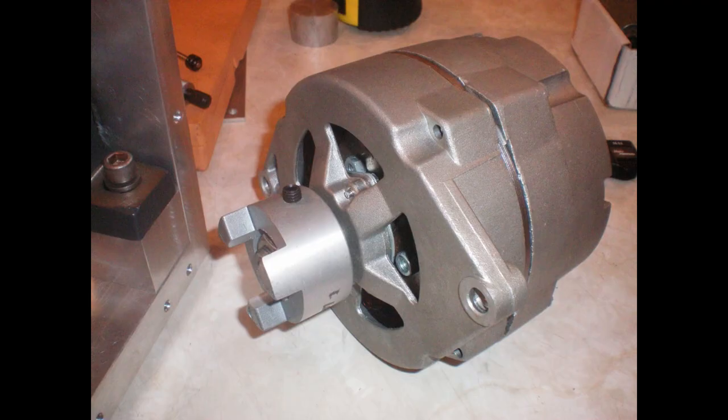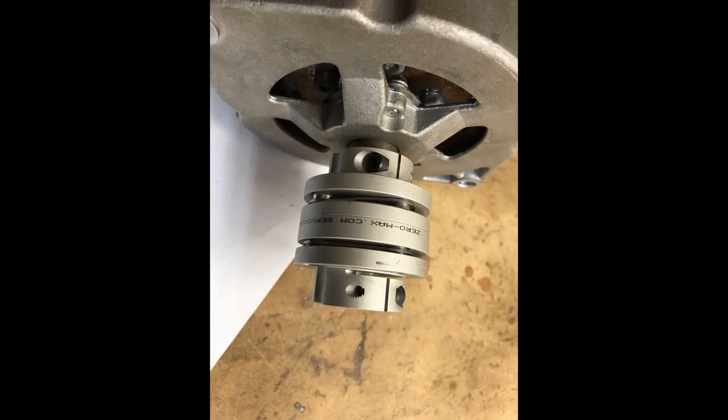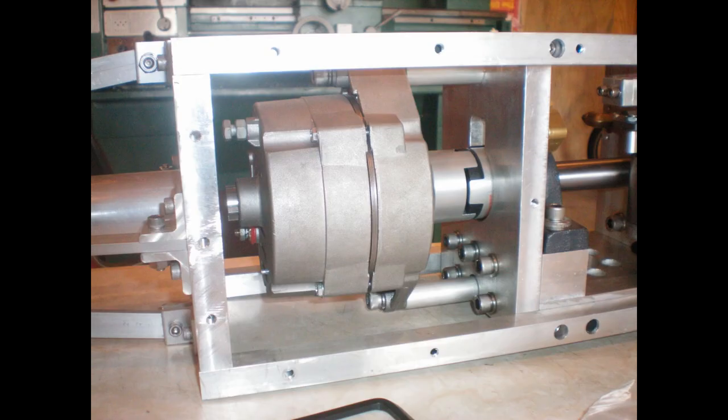Here's a view of the actual alternator — it's pretty much your standard alternator that you'd see on your car except it has permanent magnets inside. For the coupling I'm now using a style that has a wave spring wave washer. The original coupling I used was just the Lovejoy with the plastic spider in the middle, and I wouldn't recommend those — what happened in the winter was it made a lot of clicking noise because the rubber got hard as the temperature got colder. So the wave spring type is way better if you're looking for a coupling.